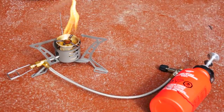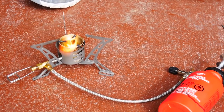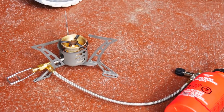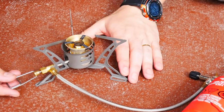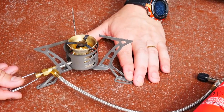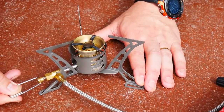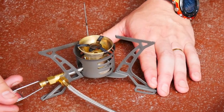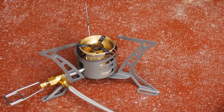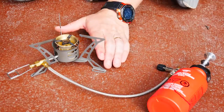Now you want to wait, okay? And you just want to let it completely burn out, maybe 45 seconds. There's a temptation to turn it on before it fully stops. And if you do that, you'll see here, you're going to end up burning liquid. Like that, okay? It's that big, like that. That's just liquid, all right? So you want to just let it preheat. Just be patient. Let it burn itself out. And then after it does, you should be able to light it up pretty easily.